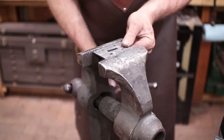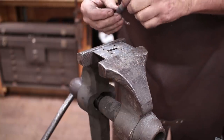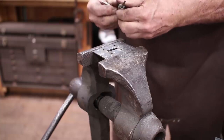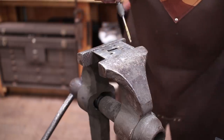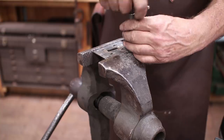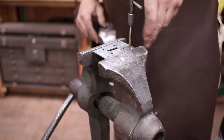Our plate that gets the threaded holes needs to be threaded for a number 10-24 machine screw, which I happen to have soaking in the acid bath so that they'll be ready to go. This is only 1/8-inch thick, so this won't be super strong, but with four of them I think it'll be plenty of strength.